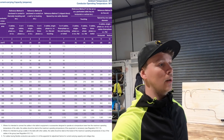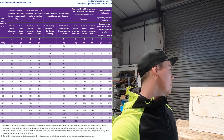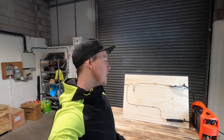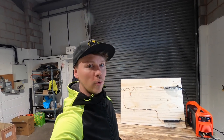So I'm going to get the thermal imaging camera out, I'll set the stuff up and we'll start low. Because this cable is rated 2.5 mil. To you guys that aren't sparks, all the guys that are learning — if you look on your on-site guide or your IET books, there's a chart that will tell you how much rating each type of cable will go up to with the different ways and methods they are run. So in conduit, or clip direct on a wall, or through 100 mm of loft insulation, all that sort of stuff. The rating for this cable — 2.5 mil solid core clip direct — should be 34 amps. So we'll start off at 10, then we'll go to 20, then we'll go to 30. We'll check in with the thermal imaging camera, see how hot stuff's getting, and then we'll crank it up high.